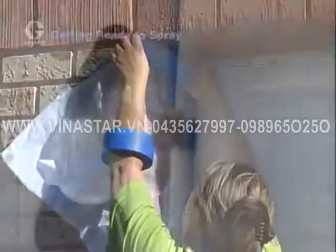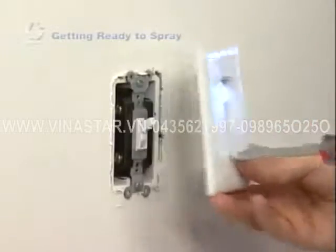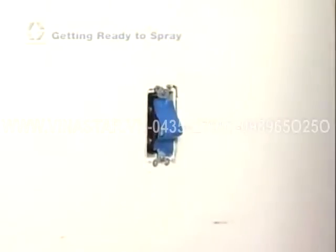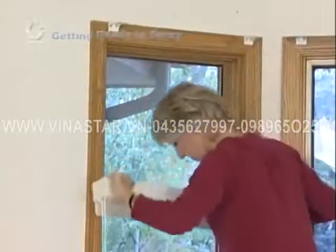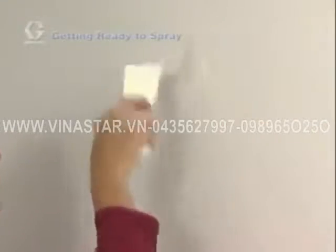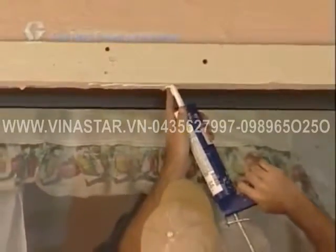Mask and paper around trim, doors, and windows. Turn off the electrical supply to the area and loosen or remove cover plates from light fixtures and electrical outlets. Remove heating and air conditioning vent covers. Also remove any drapes and the bracket hardware. If painting a door or its trim, remove the door and place it across two sawhorses or a table. Remove all the hardware from the door. Repair all nail and screw holes with a spackling compound using a putty knife. Look for cracks or holes and fill them with putty as needed. Remember to sand any rough areas. Scrape off large areas of peeling paint, and caulk or fill in all exterior cracks and holes.